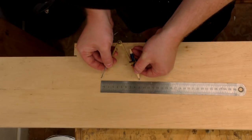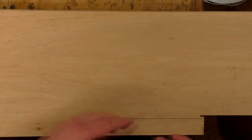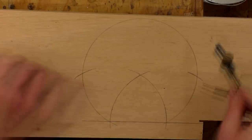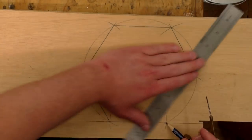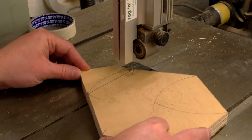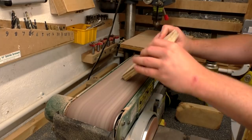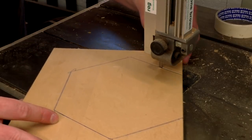Then I could make the base of each bowl. Using a ruler I set my compass to half the length that I wanted each edge of the hexagon to be, and then I used that to mark up the hexagon shape. I found a YouTube video that helped me with the method for drawing a perfect hexagon and I'll link to that in the description box. I used the bandsaw to cut out those bases, then sanded the edges and softened the corners. Because I was making multiple bowls at the same time I could use the first hexagon as a template to mark up the others, which I could then cut out and sand in the same way.